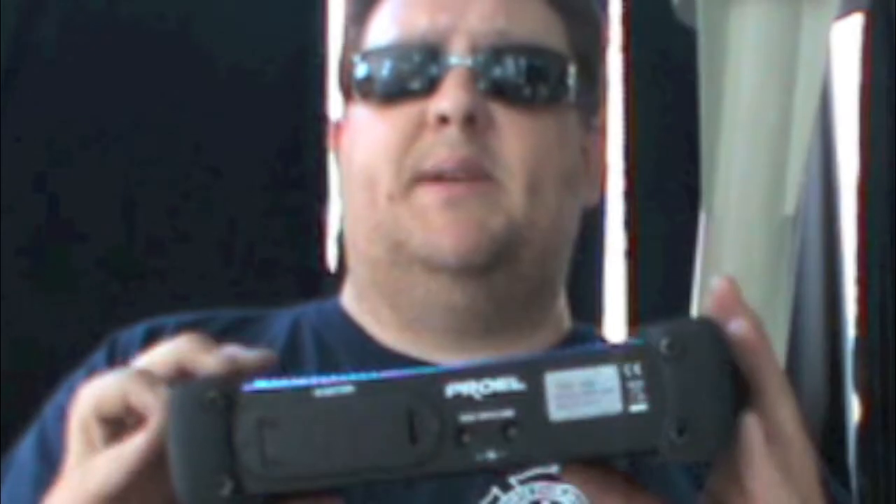They're a pain because of their size, but they do sound good. We've been using this one on a bass rig and there's no cheated low-end tone off of it. A lot of times when you go with a direct box you have to cheat a little bit of the low end, especially with the MOSFET ones like the Countryman — you lose a little bit of the low end. With these you don't, so you can actually run the EQ strip flat. That's a beautiful thing.